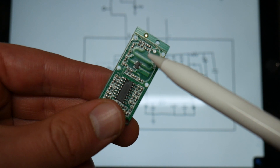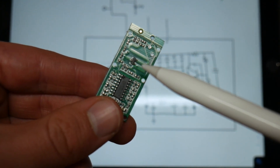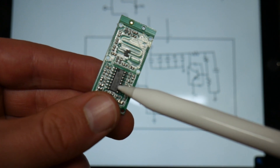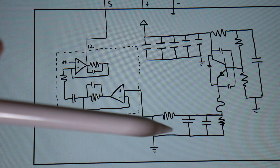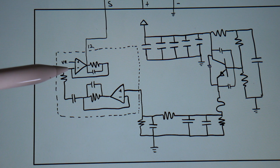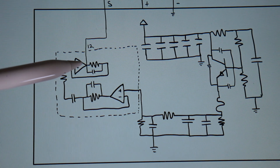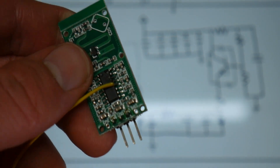While doing experiments with this chip, it's cool to have a light turn on and off, but I really wanted to see what was going on and what the raw output of this sensor was. At first I just tapped into the raw output going into the circuit, but it was pretty noisy and a pretty small signal. So I decided it would be best to tap into one of the outputs of the two built-in operational amplifiers. Looking at the schematic, I found that this was pin 12, and this would be a good one to plug into my oscilloscope and read the voltage outputs. There it is — all soldered onto pin 12. So let's hook up the oscilloscope to the other end of this wire and ground, and we'll see what this looks like.